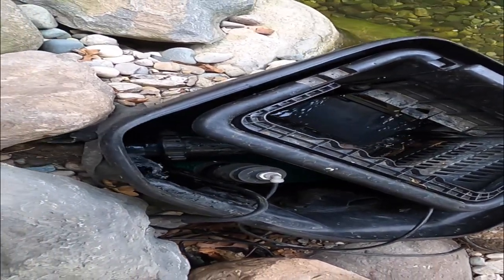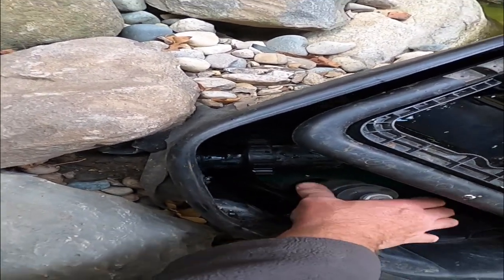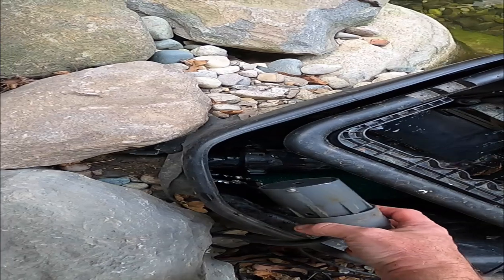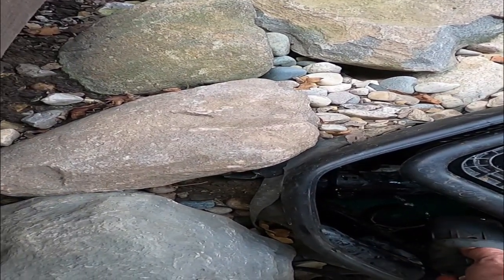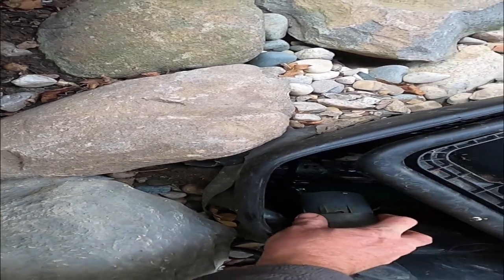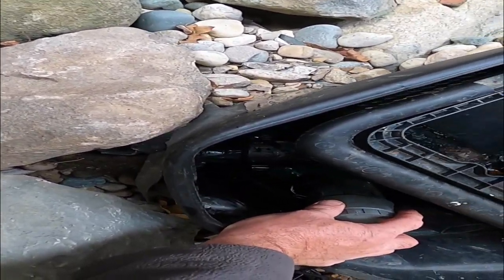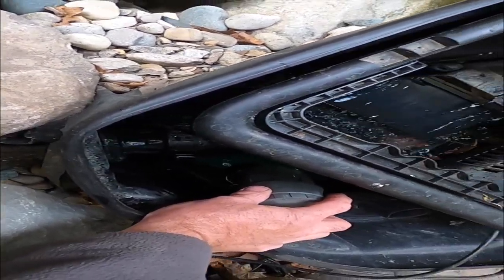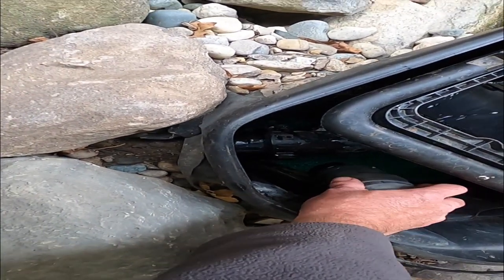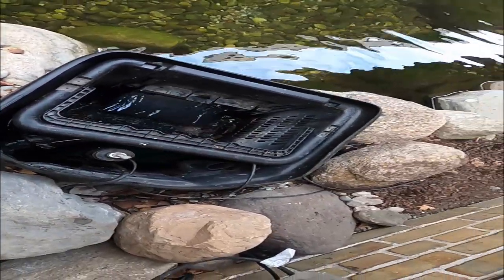As you can see, they've got the Hudson auto fill valve here. One of the problems with these auto fill valves is they won't shut off no matter what — they get little particles trapped inside them, and then they just overflow and flood out the area. That's not something we want in a backyard or in a commercial setting.